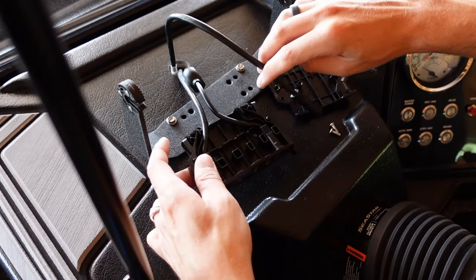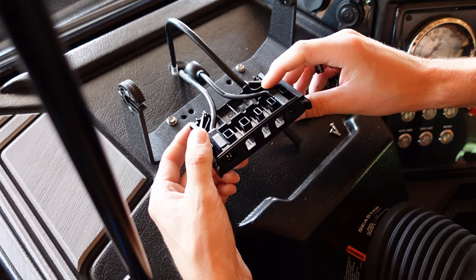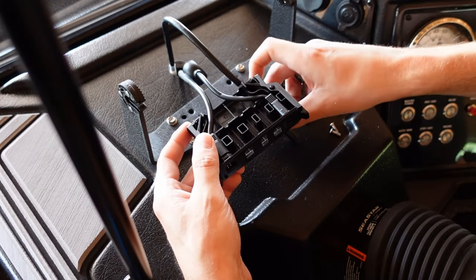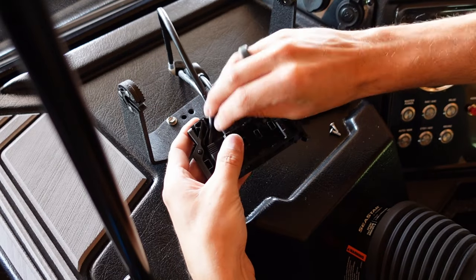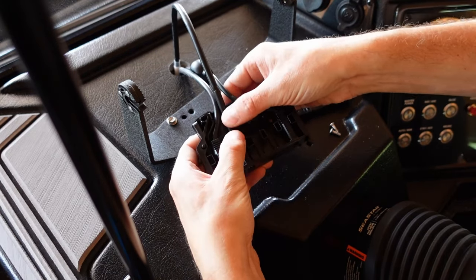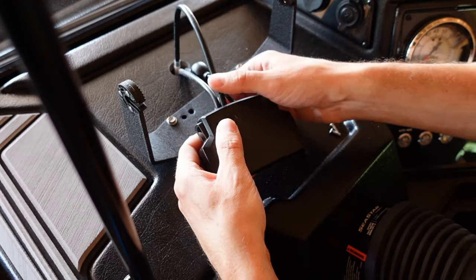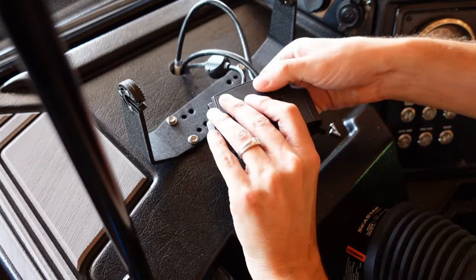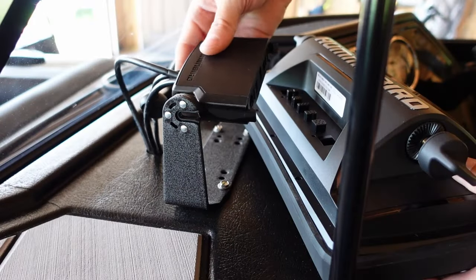For step five, if you guys have the junction box on the newer Humminbird units, you can remove the back cover, locate the Ethernet cable slot, and replace the back cover. Just two screws that mount on the back side here. And reconnect your junction box.